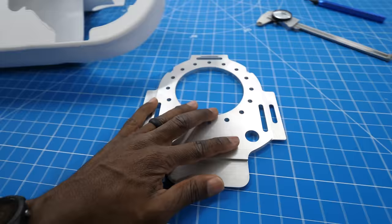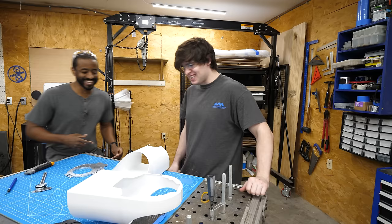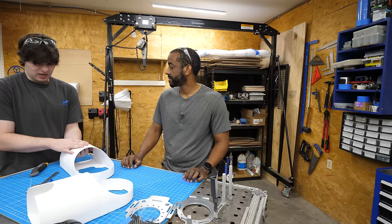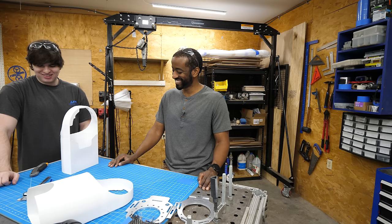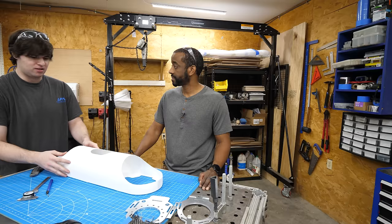Because of that, the distance between here and here is not quite enough and it doesn't fit. So that's another day and a half of 3D printing, but it's also an opportunity to rethink how to orient this on the bed for the best possible fit. Connor, who you might remember from the Yaskawa video, was helping me at the shop. He suggested cutting the part along certain planes so that dimensional accuracy between the two plates is maintained — the only place you'd lose accuracy is at the glue joint, which is mostly cosmetic.